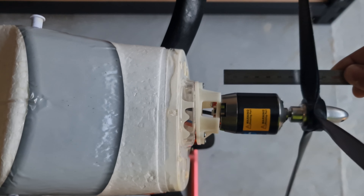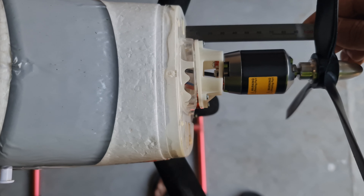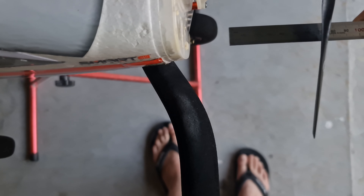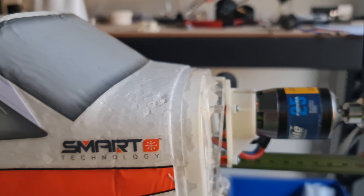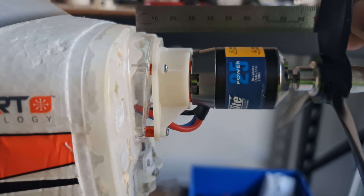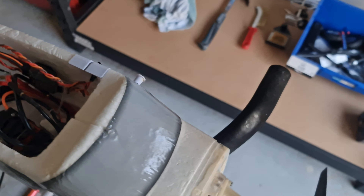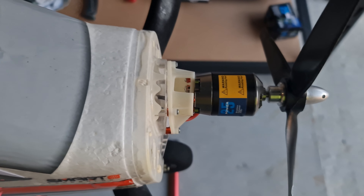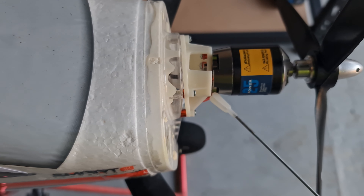What I've done is gone through different segments and measured off the pitch of the prop, comparing one side to the other, then gone underneath and compared the pitch from top to bottom to work out the misalignment.